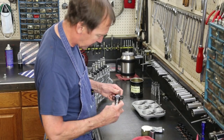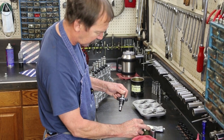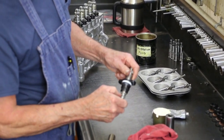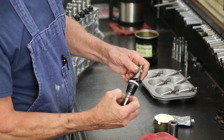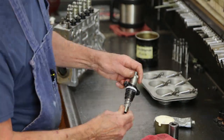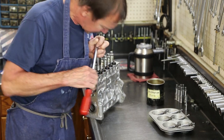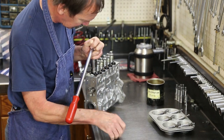You also don't want to pack between your O-rings with grease. You just want to use enough grease to barely lubricate them. If you put too much grease in there, you stick it in the housing, pressure can build up in that area and seize the barrel and plunger. Not good. The adequate amount of grease, they pop right in without cutting the O-rings.